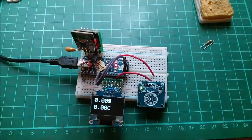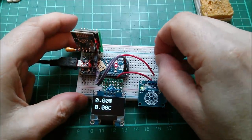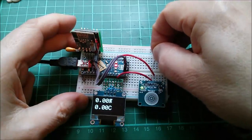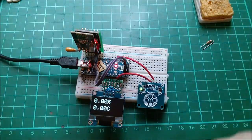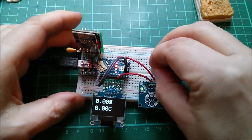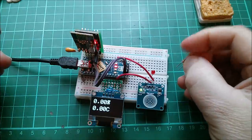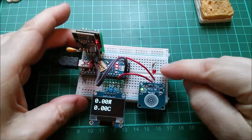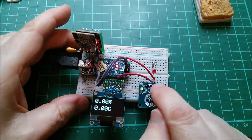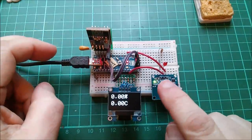I need to put another LED on there, but I've got to make sure it doesn't draw more than 8 milliamps — I think it would just get hot and get cross. The LED needs to take its feed from VCC. I've got a 1k resistor, so at 5 volts the maximum current is going to be 5 milliamps, which should be fine. Then I've got to take the other side of that to the signal pin.